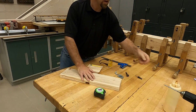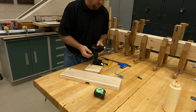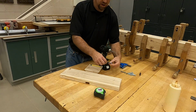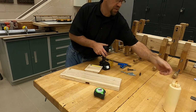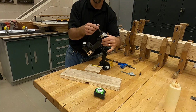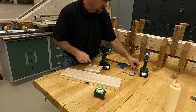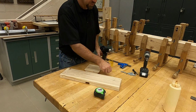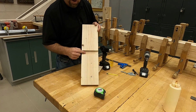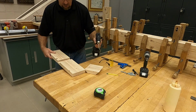So like I was saying, right now I have the lag screws, I have a countersink, I have my Forstner bit, and I have a screw gun with the setting where I can put a socket on it and drive my lag screws in. Now what I want to do is, like I said, I had measured 1 inch in from the center on these. What I want to do is just drill a pilot hole